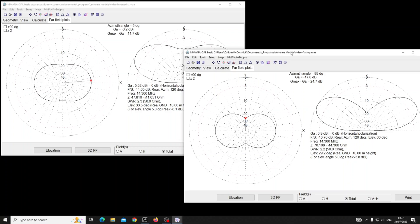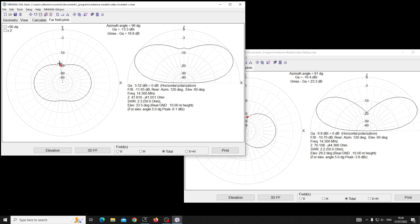Quite interesting. I don't think it really matters all that much — as somebody said in the comments, any antenna is better than no antenna. Lower to the ground, an inverted V gives you a more omnidirectional pattern; higher up, the flat top has less of a null off the ends. Has that settled it? If you've got more topics like this you'd like me to cover, let me know in the comments. Have a jolly good week, thanks for tuning in, see you next time.